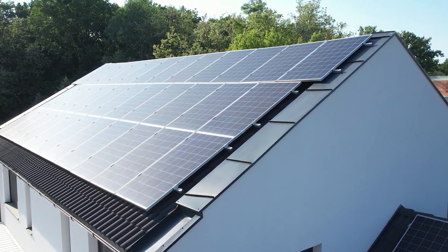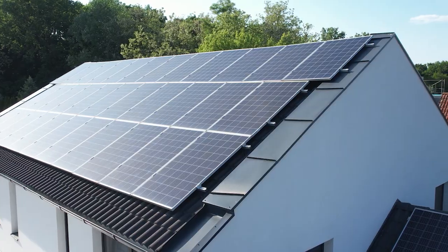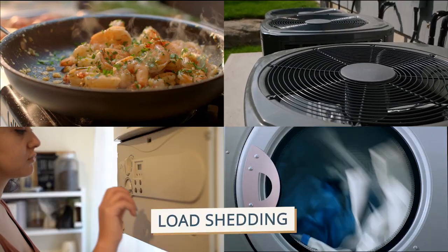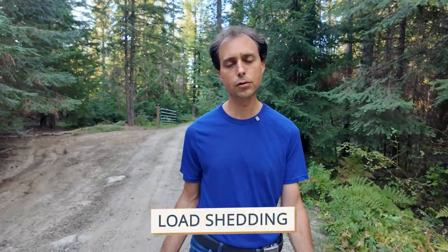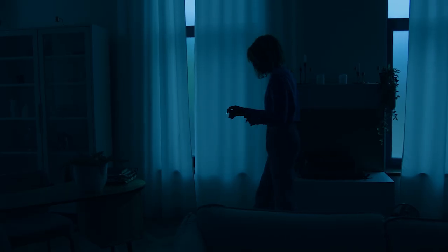That's where the real surprise hits folks who bought into this hype. They thought they were buying a grid-tied battery backup system that could power their whole house, but they didn't plan for load management, the reality of big appliances surging when they turn on, and battery limitations. They're told they need to add a load-shedding device, which prioritizes big appliances and turns off anything overloading the inverter — but that only solves the immediate overload. You're still consuming massive power and discharging your batteries crazy fast. If you haven't planned for that, you'll have another blackout pretty soon.